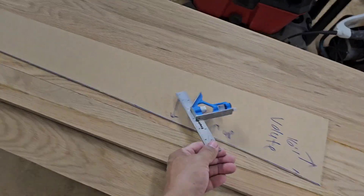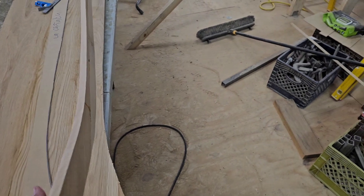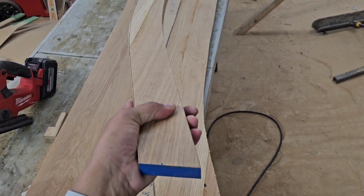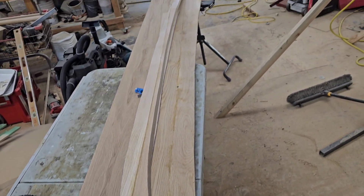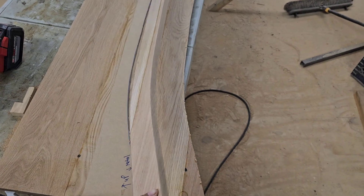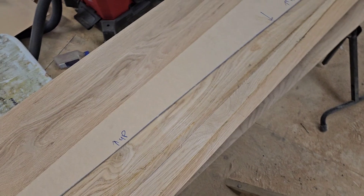Because this has different curves, I can't hit it with a straight saw - I gotta follow what the metal rail has over there. So now I hit it with the belt sander and then I scribe it onto the next piece to cut the next two strips.